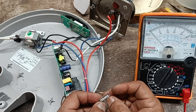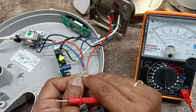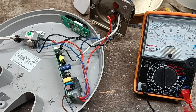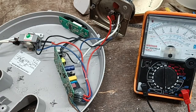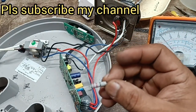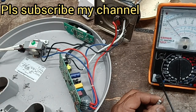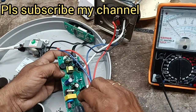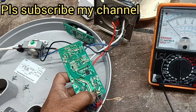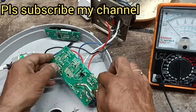let's see, the resistor is opened, and here physical damage has occurred. Okay, there is no resistance in the resistor. Okay, let's put one, this is the 22 ohms resistor. We put a same value resistor in that place, and we insulated one side of the leg and put the resistor in the board, soldered carefully and cleanly. Okay,